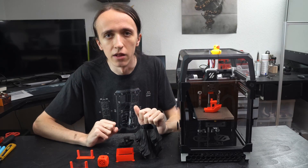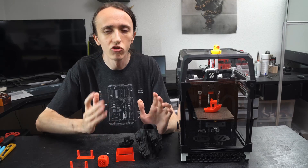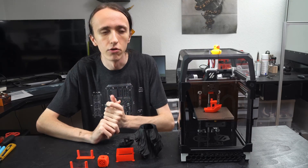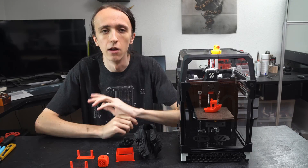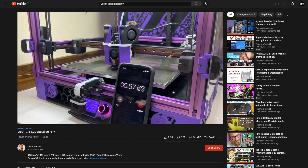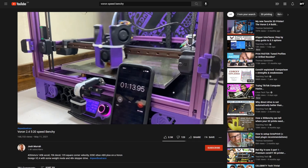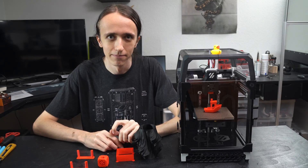The quality-setting speed of this machine, where I take it slow and make sure everything is printed nicely, is about the highest I can achieve on my Prusa, which is already a fairly fast machine. Compared to something like an Ender 3, Sidewinder, or any of these other cheaper 3D printers, the quality speed of this is probably about twice as fast as the speed preset on those machines. If you ever want to see something really crazy that blows your mind, Google 'Voron speedboat race' and you will see some printers that go so fast you will not believe it is not time-lapsed. Some people have managed to print a 3D Benchy - which on an industrial machine takes around two hours or on a Prusa maybe an hour and a half - in under five minutes on one of these machines.